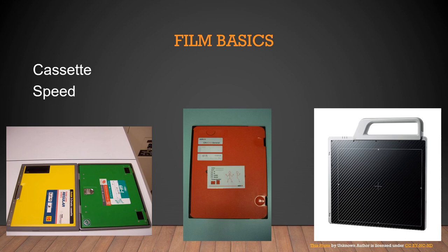Or I would tell the machine: skull or spine x-ray, and it would apply a 400-speed system. It would change the speed based on the body part I was telling the computerized radiography system. The black digital cassette on the right is the image receptor — the same cassette used for everybody. I would select the body part, tell the machine, and it would change the speed of the system accordingly.